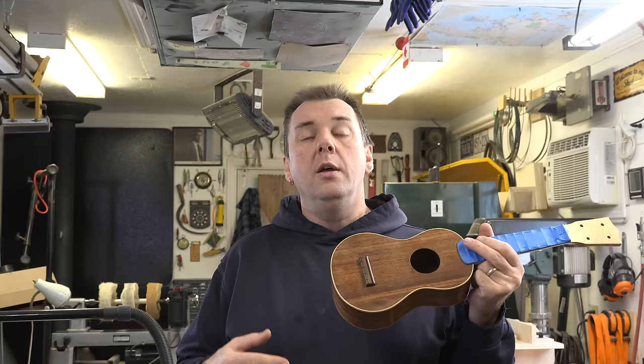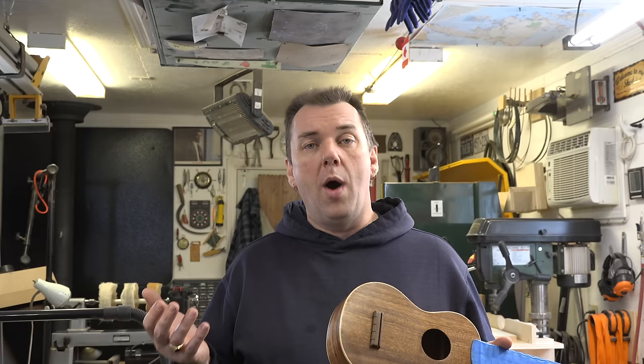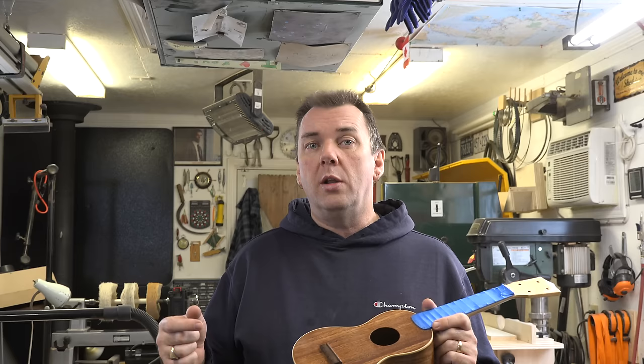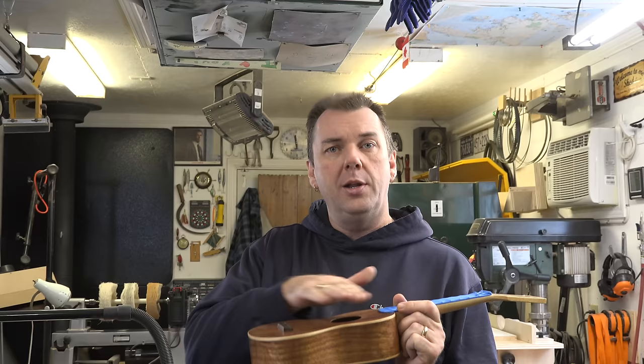There's one more step that's optional, and if you want to do it, and I don't think I'm going to, who knows, but there won't be a film of it. I'll just explain it. Basically, it's your finishing coat, and it fills in all the last little blemishes that you didn't see. All you do is mix a 1 pound cut of the shellac. And if you don't want to mix more shellac, just thin down some of what you have, 50%. And you just want to load your pad, and with that airplane motion, finish it off with several coats to give it that last little bit of shine and shimmer. So that's kind of the finishing coat. So after that, you're done.